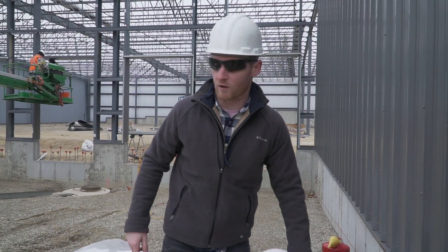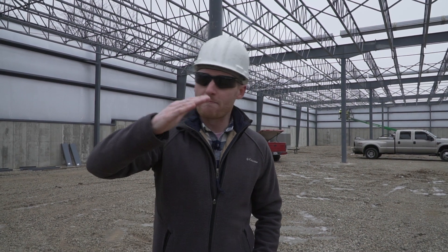They're all labeled for us around the doors. At this point we don't have the roof on, and the reason is that in winter when snow melts, water comes down on the guys when they're trying to insulate and sheet it. If we're in fall, spring, or summer, we'd put the roof on first. But in this winter application, we go ahead and put the walls on first, then put the roof on so it doesn't leak on the guys while they're installing the walls.